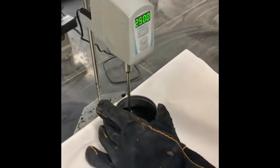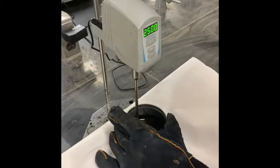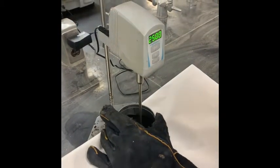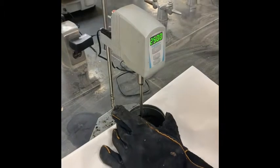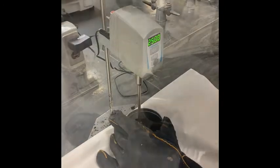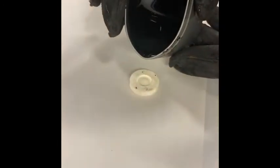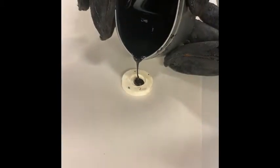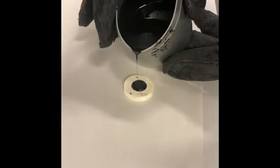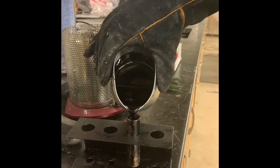Be sure to hold the canister with one hand and spin it around to thoroughly mix the sample. For the DSR test, use a 25 millimeter mold and pinch the container to pour it into the mold. For the rotational viscometer, fill the mold halfway up with asphalt binder.